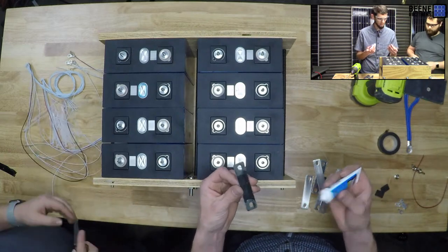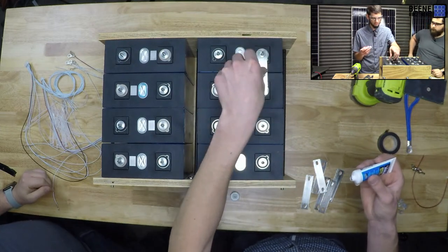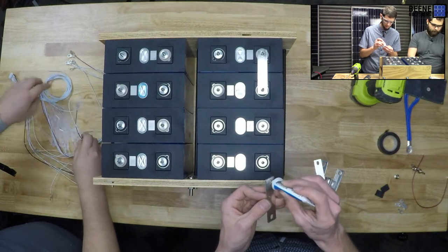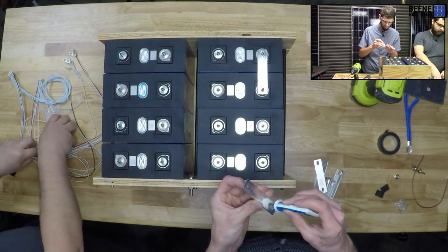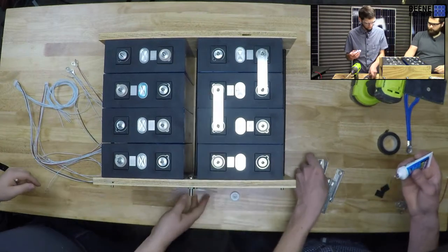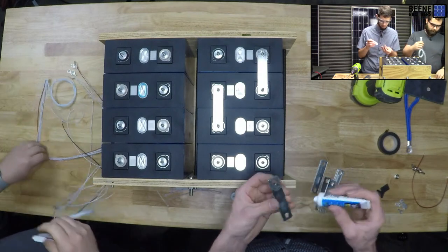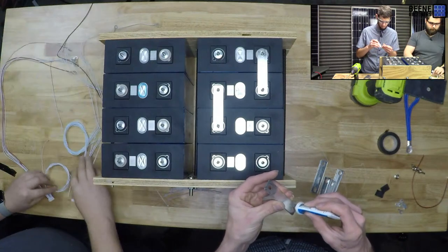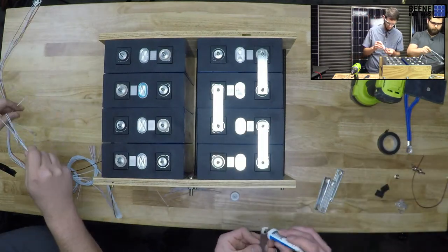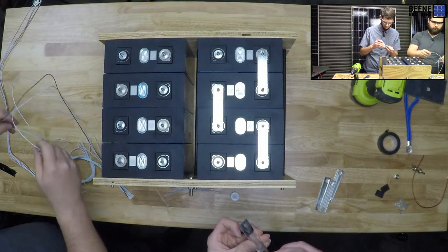I was talking with one of our customers, and he's an electrician. He never did solar stuff, but he's like, oh, yeah, I got this stuff I'll put on the batteries. And I'm like, oh, that's right. I even lived in a house that had aluminum wiring. This is the kind of stuff you would put on your connections or inside your totally not approved wire nuts to prevent oxidation, because it wasn't the aluminum wiring that made your house catch on fire. It was the fact that your aluminum wiring would oxidize and create a bad connection to other types of wiring or to other aluminum wiring. That was my observation anyway. So having something like this in there keeps the oxygen out, and with no oxygen, you can't oxidize or rust.